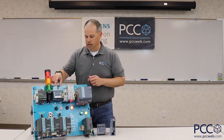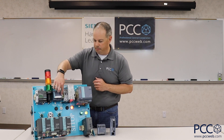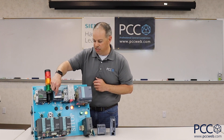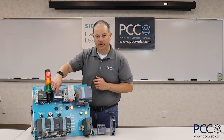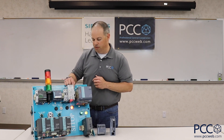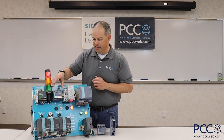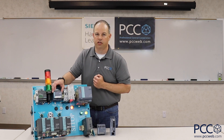As you can see, if I take the output of my power supply and wire it through the diagnostic module, the module breaks it out into individual circuits that have their own overload settings via a dial. I can use the buttons on the front of the unit as on/off points to turn circuits on and off for testing purposes — and that's also my diagnostics. When there's a problem on a specific circuit, that unit will trip, unlike those miniature circuit breakers and fuses. So we put these on the output side of our power supply to get those diagnostics without taking the complete control system down.